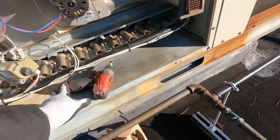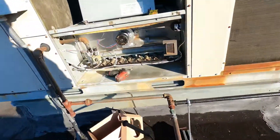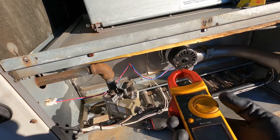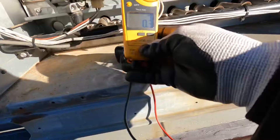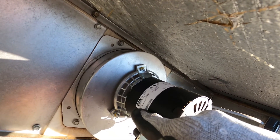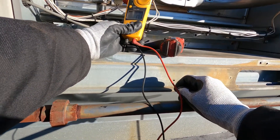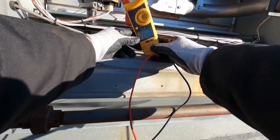Because there's a call for heat, we're going to test this motor. Let's get a meter — you always want to make sure your new motor is working correctly. I need to calibrate my meter because I've had problems reading low amps lately. Set it to amps. Reading 0.45... 0.3 amps, and the motor is rated for 0.55. So it's not over-amping. The motor is running pretty good — we're back on.